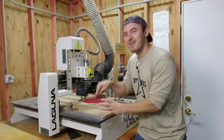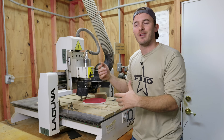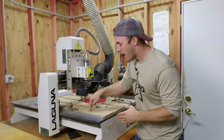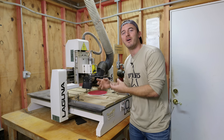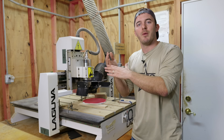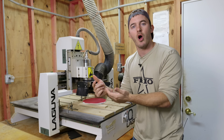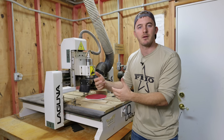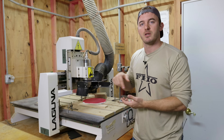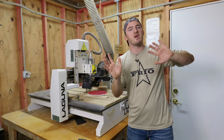When I was a beginner I made this same mistake. You think you're being safe and protecting the bit by running it slow, but it's screaming at you and producing fine powder — and that's not what you want. Running a bit too slow causes it to rub and create friction, heating the bit up to 200–300 degrees, dulling it, affecting its structural integrity, and eventually breaking it or turning it black. Slower is not safer.